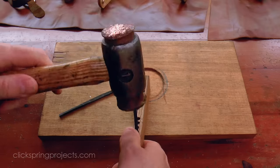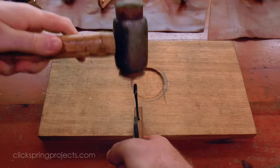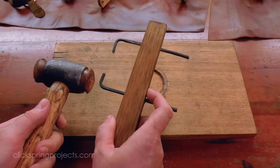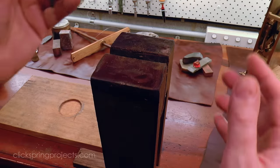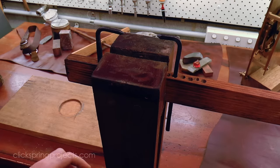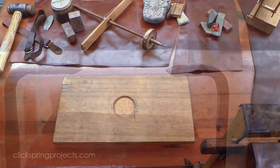The tool must be able to produce well-finished bearing surfaces to close tolerances, and the operator needs to be able to get physically close to the work to be able to see it well enough to assess progress, all of which suggests a tool on the scale of something like this. In my case, I've let the prongs into a piece of wood that I can then hold in this work-holding device, but they could just as easily be let directly into the bench, or put in some sort of standalone frame. The key feature is the opposing points, between which the work is caused to rotate.